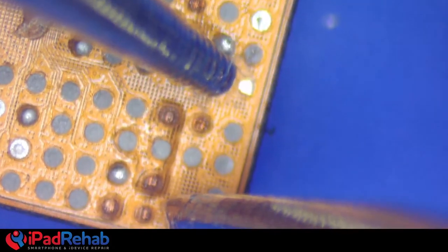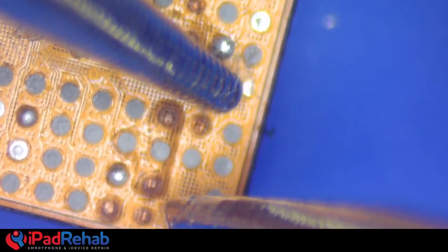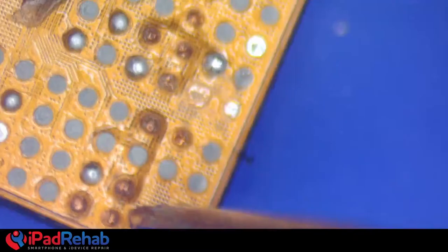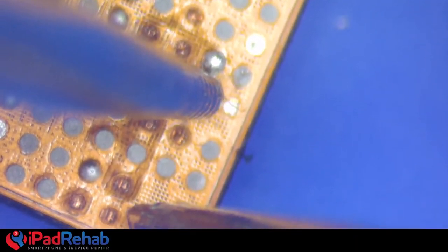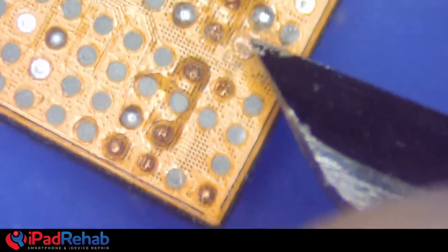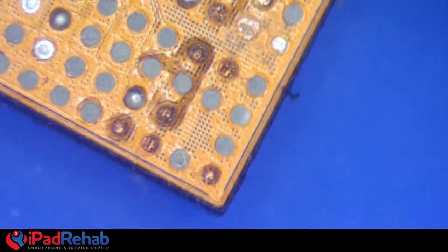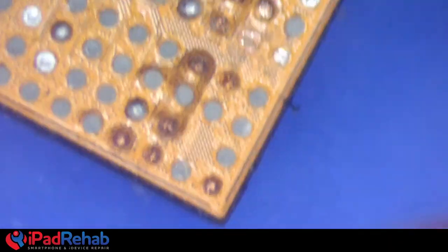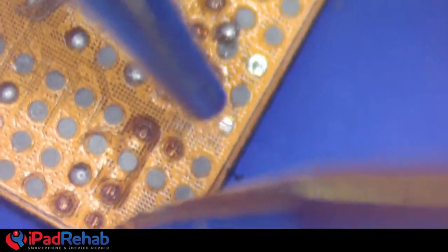So there we go. We got a 0.27 there. So this is a multimeter in diode mode where you've got the red probe on ground, which is the corner. Yep, corner's always ground. And then making sure I'm not touching the ball next to it. All right, we're gonna get rid of that ball. Oh, you're gonna get rid of that because it's ground? Because I don't want that to interfere with taking measurements for demonstrative purposes. Okay, I see.